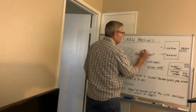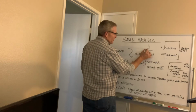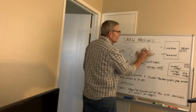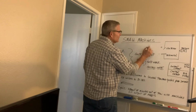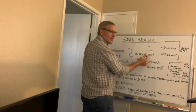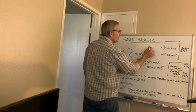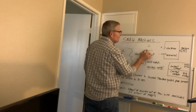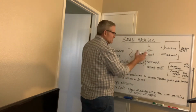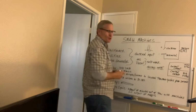When I weld, I like to keep the electrode close to the material so that I am, in essence, telling the material where to go. As you back that electrode away from the material and you're way back here, the metal doesn't know where to go, but it's still trying to complete the circuit. So if you're close enough where it can complete the circuit, it will. However, the metal doesn't know where to go. So you lose that control in the weld zone itself. So I'd like to suggest to you, keep the electrode tight to the base metal as you're doing the welding.